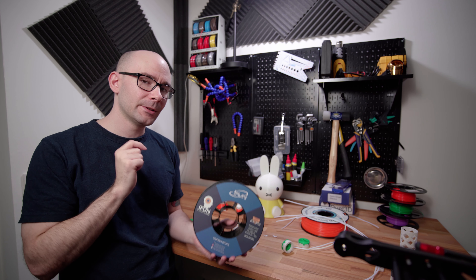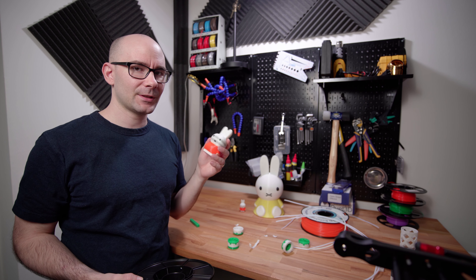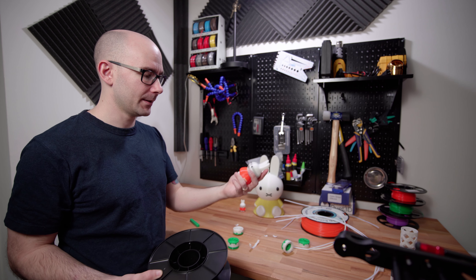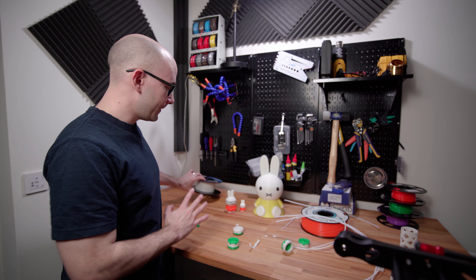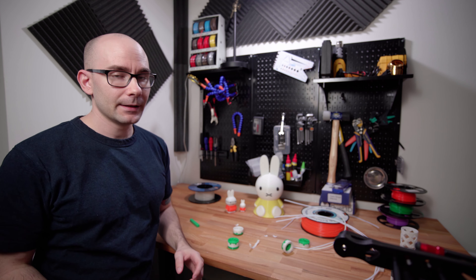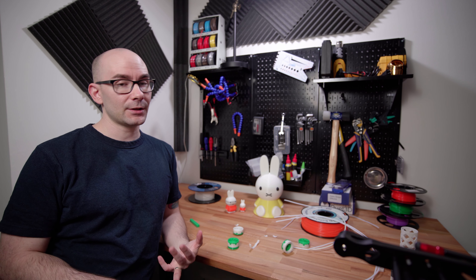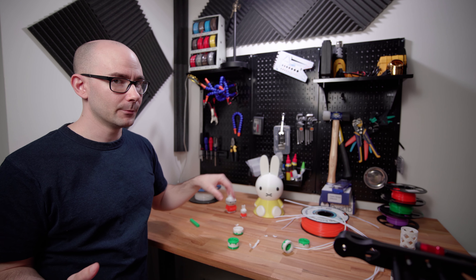I had to do it every time it switched over from white. This one was supposed to take like six or seven hours or something, and it ended up taking multiple days because of all the mess-ups and me having to constantly pull those strings out. So iFun's not a good filament — make sure you use new filament and quality filament. I used Hatchbox for the big one and this little guy, and I didn't run into any more issues.